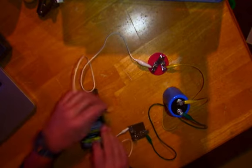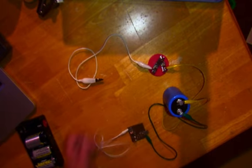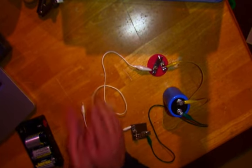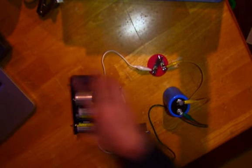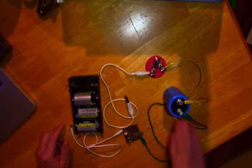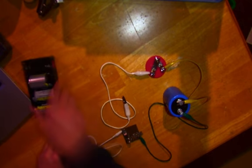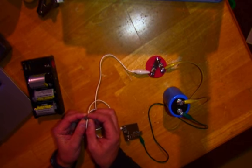So when we hook up circuit B, what's happening in this loop? What's happening with the capacitor is that the capacitor cannot light the bulbs all by itself. However, after the battery's been in the loop, the bulbs do light temporarily. So after some discussion with the kids, the students suggested that maybe when the battery is in the loop and the bulbs light temporarily, the battery pushes charge around the loop and charges the capacitor. So that temporary lighting of bulbs with the battery pack, wires, bulbs, and the capacitor, we're going to call charging. When we remove the battery pack and the bulbs light temporarily, so you have a capacitor, wires, and bulbs, we're going to call that discharging the capacitor.